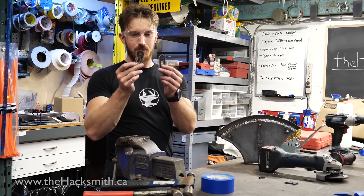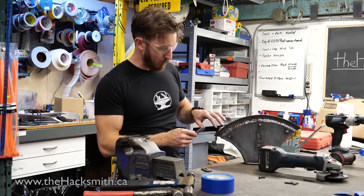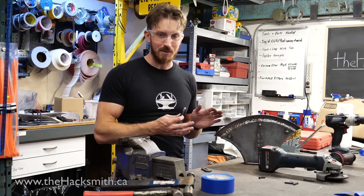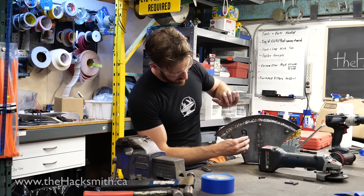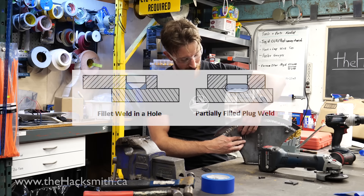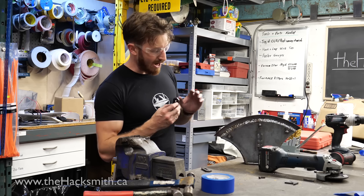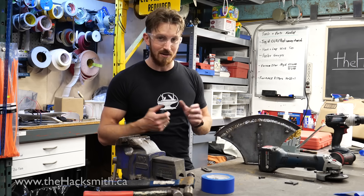The reason I drilled these holes is because I actually kind of forgot something in the design. For some of the decorative pieces, we want to weld them onto the axe without showing any weld bead. The way of doing that is something called plug welding. What we can do is attach to the surface and then start welding inside the hole, and that'll hold it down. This is how we did the majority of the Wakandan shield, and it's how we're able to have such clean lines, just using a plasma cutter and a welder.